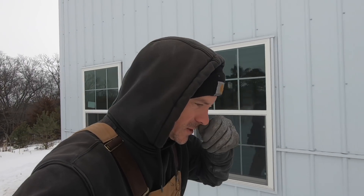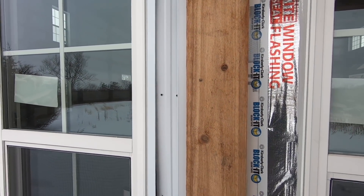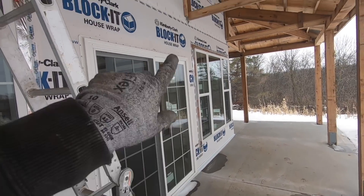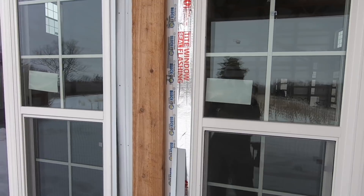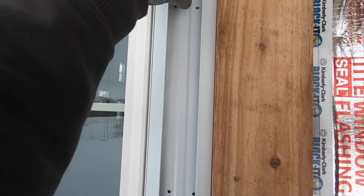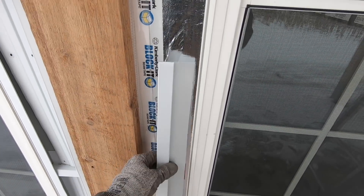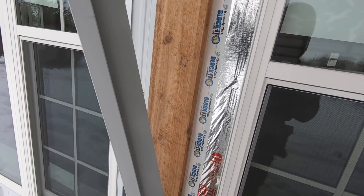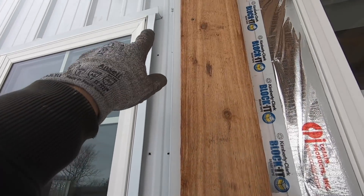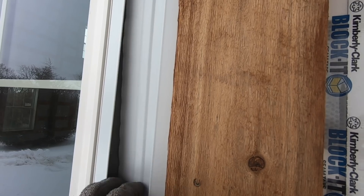There are a couple things I can share with you, and we will start out with this piece right here. So between all my windows, even up above between the windows, I planned it out — well, I didn't really plan it out — there's a rib in between each space which stiffens the piece. It just so happens that this piece right here has no ribs, so as you can see it's pretty flimsy. So what I'm doing is I got this hem trim — it's just a straight trim — and I cut it to length from here up to there, and then I'm going to slip it on over this edge.